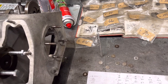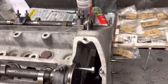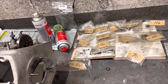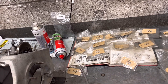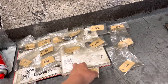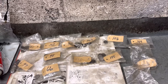We adjust the shims to suit. If you've got a 50 thou shim in there and you need to close the gap up by 3 thou, you put a 53 thou shim in — simple as that. The problem is we've only got a certain number of sizes, and every now and again you need to grind some shims to make them smaller. So if we've only got a 96 and a 100 and we need 98, we'd take the 100 and grind 2 thou off it.